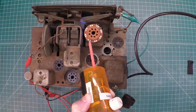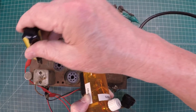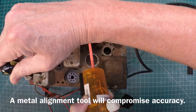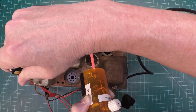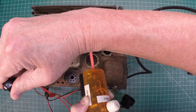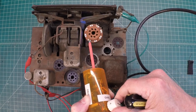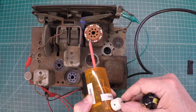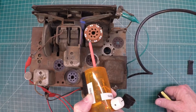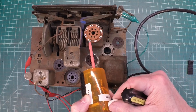This one's just a little tight. Let me grab my metal screwdriver — a little heat shrink on it. Okay, that seems pretty close on that adjustment. And that one appeared to be spot-on as well. So I don't think anybody has tampered with the IF alignment. Looks like I did move this one just a bit, but again, this is not a true test or true IF alignment. It's more just to show an example of how I'm able to trace the signal all the way through a dead, unpowered receiver.